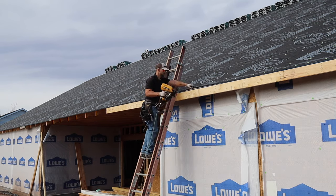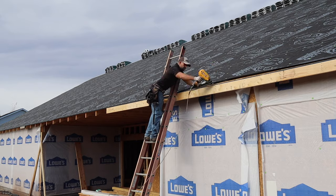Here I am removing the L-bracket. Sometimes it can be a pain reaching under there when you can't see the screws, but it's not that bad. Another tip: if your trusses are set two-foot on center or 16 inches on center, a 16-footer should break right in the middle of the rafter. But if your layout got off a little bit it won't, so always double-check your measurement before cutting exactly 16 foot — because 16-footers are usually 16 and a quarter.